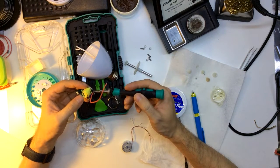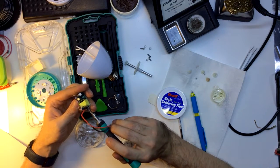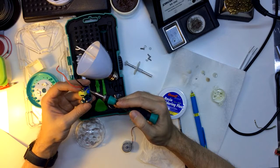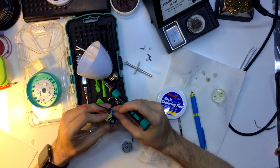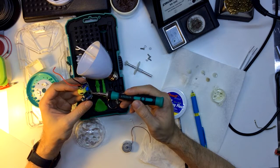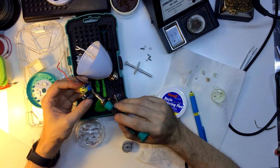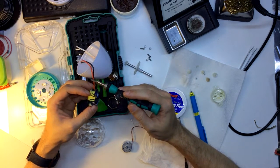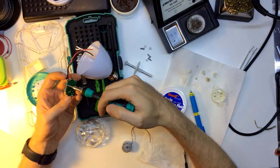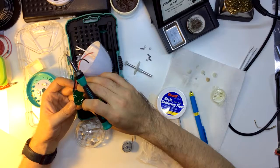The secondary windings come through this rectification diode here. I didn't look up ES1D, but it's a diode. And then also through this capacitor, which I think is probably some sort of smoothing capacitor, and this, which I believe is another isolation capacitor of some sort, probably from the feedback winding of the transformer, which allows this chip to power itself after the circuit charges up, and probably also allows it to monitor the current going into the LEDs, and therefore controls the transformer as far as how much current it's putting into the circuit. I think. That's my theory on it. We've got an anti-tracking slot here as well to keep voltage from jumping back along the traces. This circuit is way beyond my ken, though.